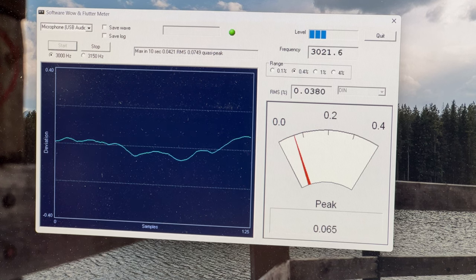Bias, EQ, sensitivity, EQ. And it looks like it did it. No error lights at all. So I'm going to go back to preset, clear that out. And yeah. If there's anything else wrong with this machine, it's probably going to be minor, because it clearly recorded something. It does record. It wouldn't have completed the autocal if it didn't record.